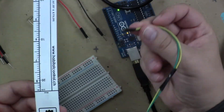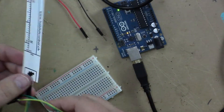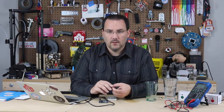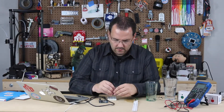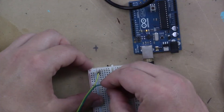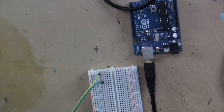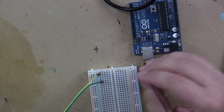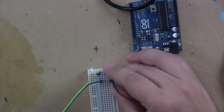I'm going to use male to male to connect the female to the breadboard. I've added some wires here because you don't want to solder to this — this is plastic and if you get these too hot, you can damage it. Pin 2 is yellow; I'll put that right in row 1, and pin 3 is in row 5. Now we can connect pin 3 of that e-tape, which is the green, to ground.